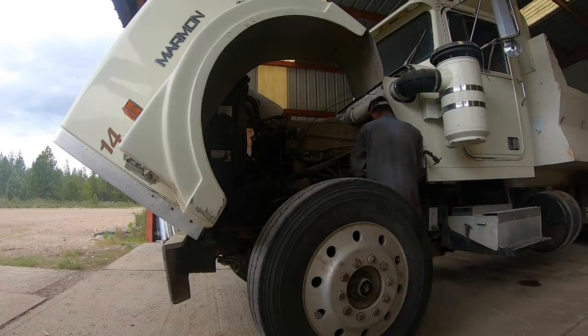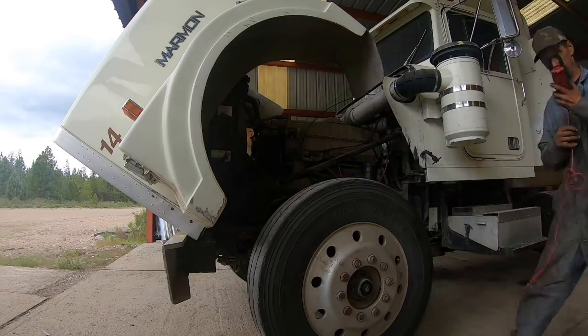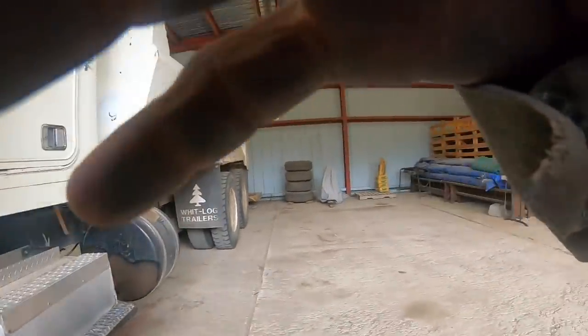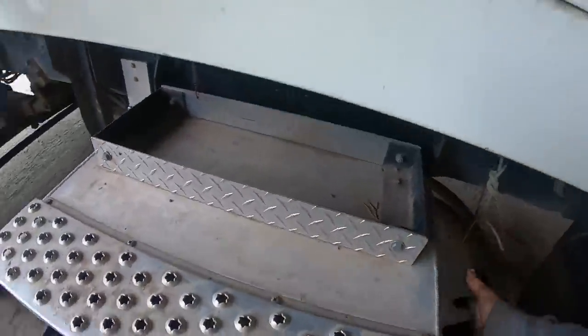On this one here, to be completely honest with you, I really don't know what happened. I think maybe the battery disconnect switch might be going bad, because I couldn't get anything at first jumping across the signal wire to the big post on the starter solenoid. I turned the battery disconnect switch on and off a couple times. I went and got a meter here, as you can see, and I started testing things. Well, all of a sudden, I got it to start.